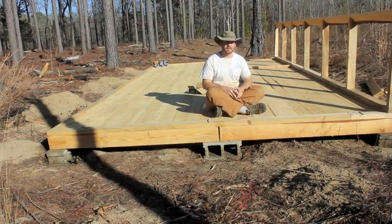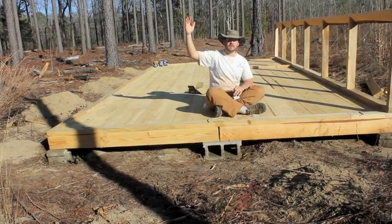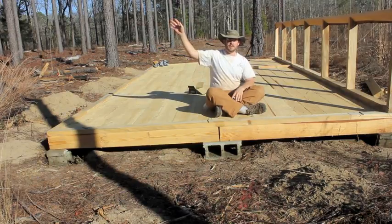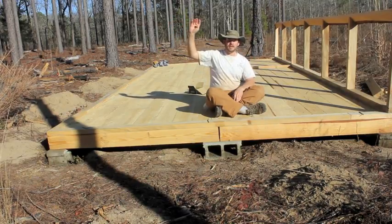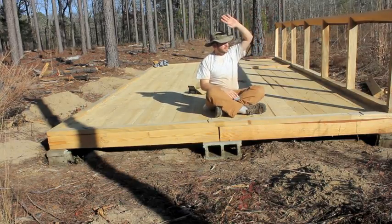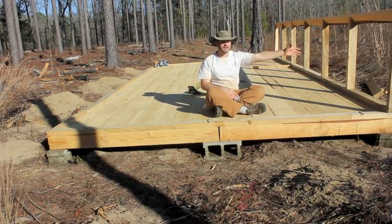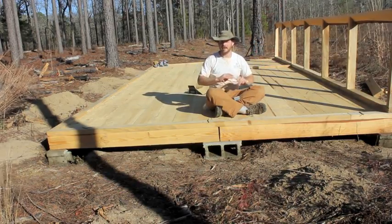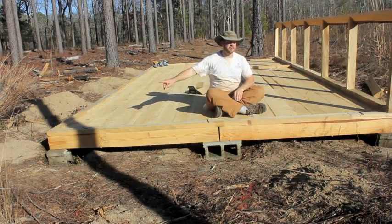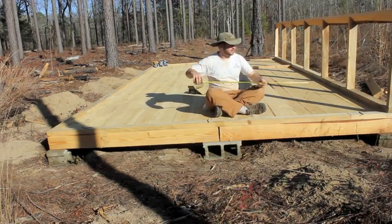Imagine how the kiln works. You've got the fans in the back on the top that draw in fresh air from a 10-inch dead space behind them with vents on the top of the back wall of the kiln. They draw in that air and then they push the warm air that's been heated by that solar panel down towards the front of the kiln, towards the front of the stack, and then through the stack. And all that warm, moist air vents out the back with the moisture from the wood, and that's how it dries. So all I really need in front of this stack is 10 inches.